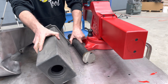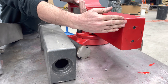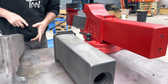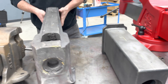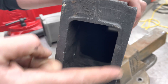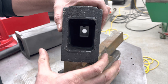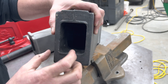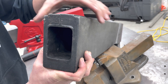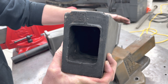This is hollow, and it's a structural member, and it is only designed to work in compression. What this allows us to do — I'll have you come over here — it allows us to box this slide. So this is a complete solid piece as far as the top of the bottom; there's no C-shape to it, and this makes this dynamic jaw extremely rigid. It resists twisting and flexing, because this is one of the largest opening vises on the market.